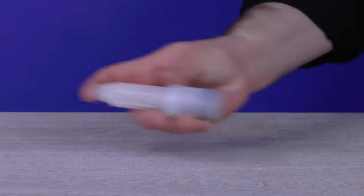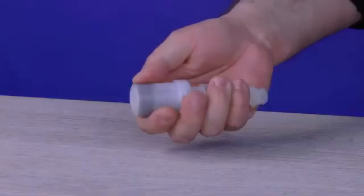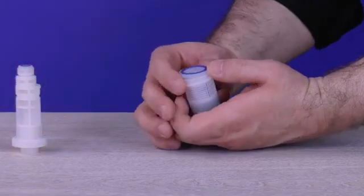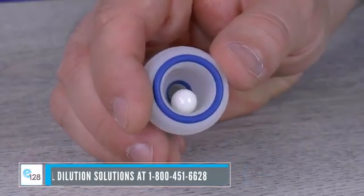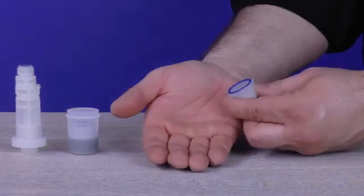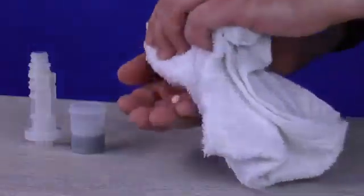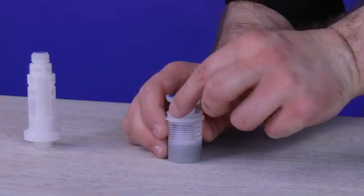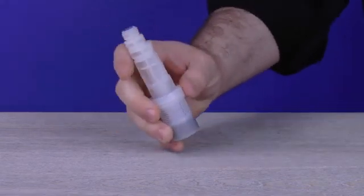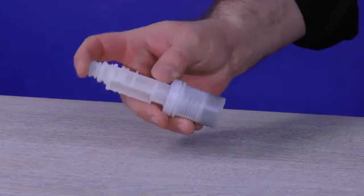Grab the foot filter and shake it back and forth — you should hear a ceramic ball moving freely inside. If not, separate the foot filter into three pieces by popping the filter basket from the filter body. The filter seat may stick to the filter body; make sure it rests in the filter basket to avoid losing the ceramic ball. Locate the ceramic ball in the filter seat. If there is no ceramic ball, call Dilution Solutions at 1-800-451-6628 for assistance. Pull the filter seat out of the filter basket, pour the ceramic ball out into your hand, and use a small towel to wipe it clean. Put the ceramic ball back into the filter seat, then put the filter seat back into the filter basket. Insert the filter basket into the filter body and forcefully pop them together — this may take a couple of tries. Pull on the two sections to confirm they are connected securely, then shake the foot filter once more to verify the ceramic ball is moving freely.